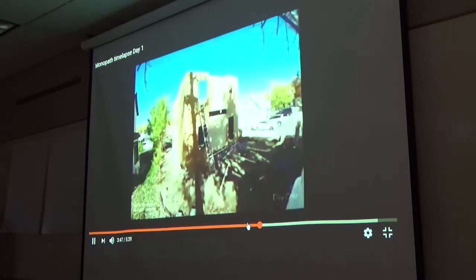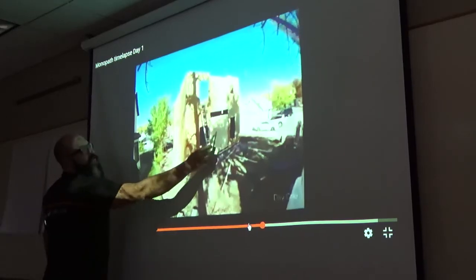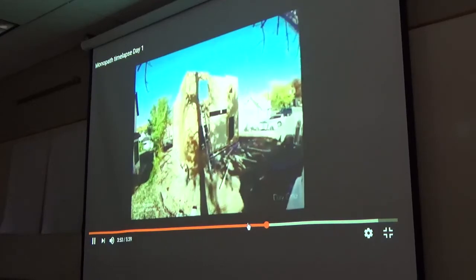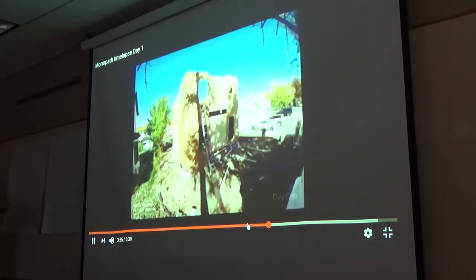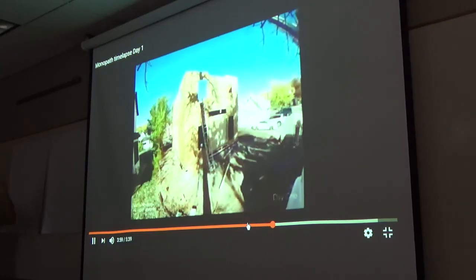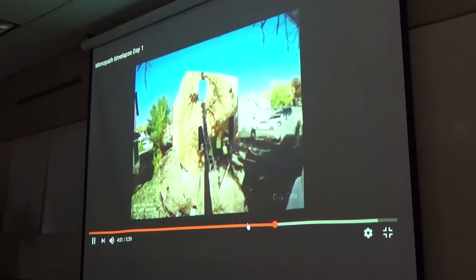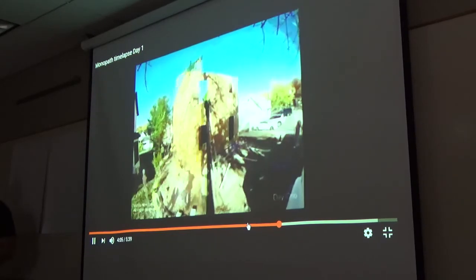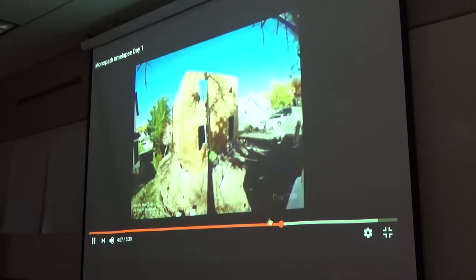You can see the very front exterior panel is still out. It's the last one that we fly in. That one obviously has to get glued on the stack before you put that up. And then when that thing goes up, you need to jump up with a bunch of bigger screws to get that glue pressed together, right? And then right away you want to have somebody going around the perimeter tacking everything off and starting that fastener pattern.